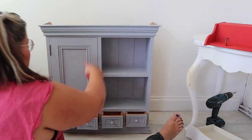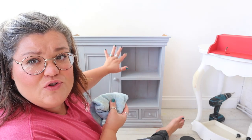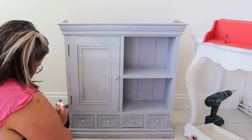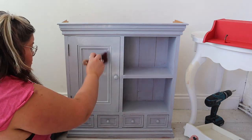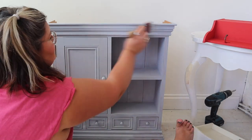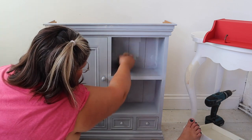I left this to dry overnight because I didn't have time to do a second coat last night, so it's had one coat. The good thing is there's no sign of bleed-through, and there's no sign of bleed-through on the knots either — a good sign so far. If you want to sand in between coats of primer you can do — if you're going for a super smooth look, use a really fine sanding sponge between coats. Then a quick wipe down with a dry microfiber cloth to grab any bits of dust, and then straight in with the second coat of Boss, applied the same way as the first with a synthetic brush. There was no apparent bleed-through on the first coat, so two coats will be absolutely fine. Some pieces may need an additional coat but it really does depend on the piece.